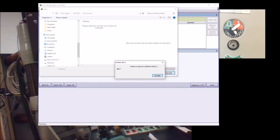Our question would be, I don't remember exactly, what current is being injected when you're doing the contact resistance? What current is the unit delivering? The unit is able to inject a maximum of 10 amperes. But it will adjust the actual current to the minimum possible, in order to take the minimum power from the battery. So if it finds that the resistance is large, it will use very small current. But if the resistance is very low, it will use much more current in order to increase the voltage drop. So it will automatically adjust, but the maximum is 10 amperes.